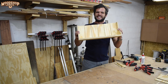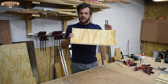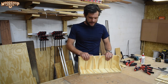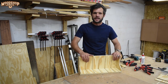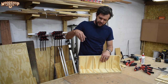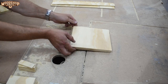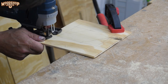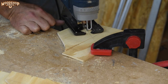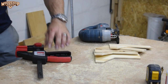So this is pretty much the basic framework or body of my screw feeder — I've got the backing, the base, and the two sides. From here I'm going to install dividers to separate the different types of screws I want to store. After that I'm going to install a front piece or face piece which will basically enclose each compartment to contain the screws. The bottom will be open for the weight of the screws to feed through to where I can access them. The biggest difference between the end caps and the dividers is thickness — the end caps are half-inch pine plywood while the dividers are quarter-inch — but besides that they have the exact same L-shape, so I use the same technique to make them.